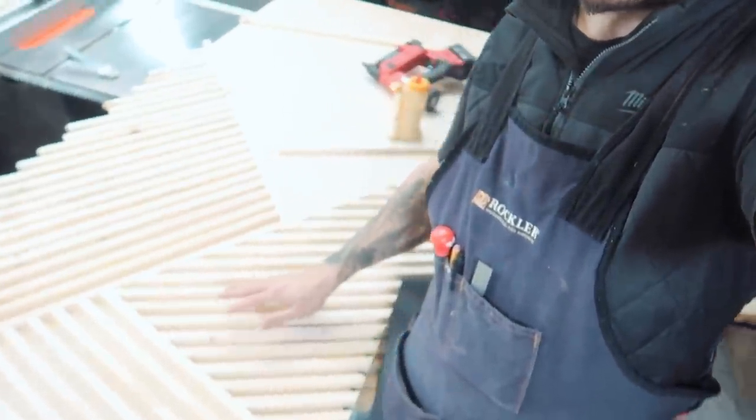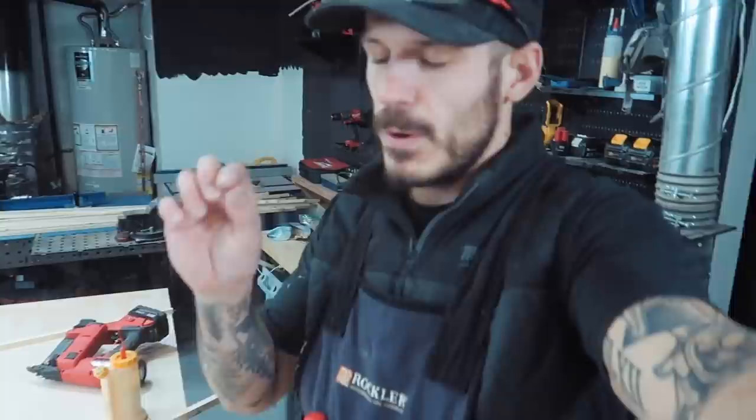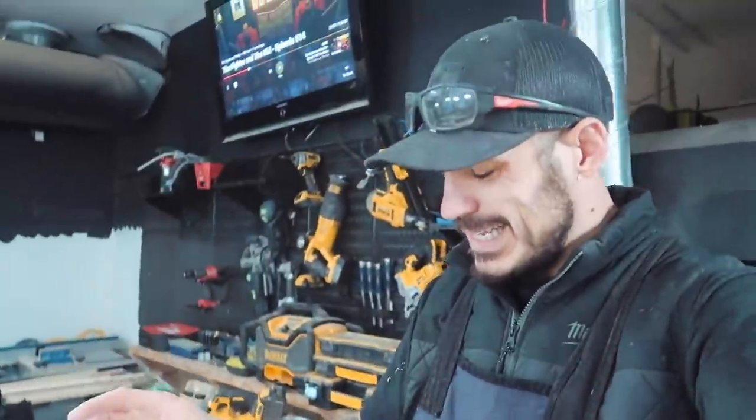The project is coming out really good so far — all the joints are lining up pretty well. For certain joints that needed 65 degrees, my miter saw only goes to about 60 — no big deal. I took a little sander and took a bit of that edge off to make it look flush. I think this is going to be one of those good projects, so stick around.